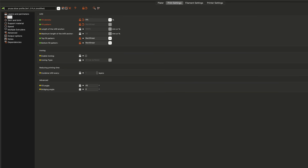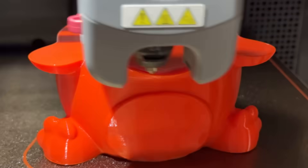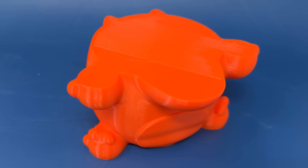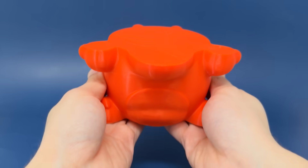The very first and most common way of making a 3D print heavy is to just make it solid. But this is probably the worst way. Even though it is the densest way — fully solid plastic with no voids or gaps — the problem is it takes a really long time to print, uses a lot of material, which is expensive. And something heavy is really expensive to ship.